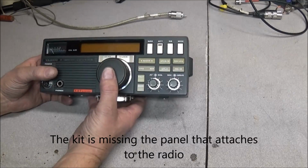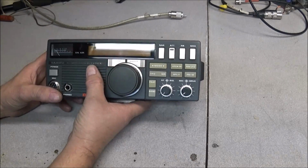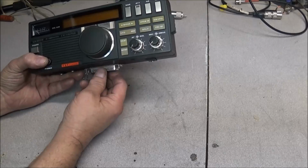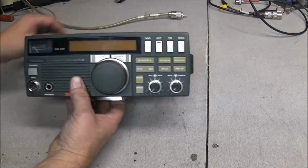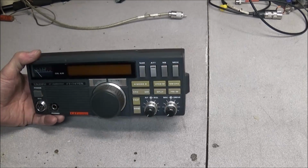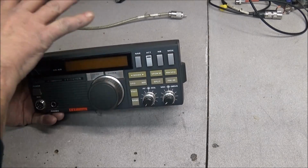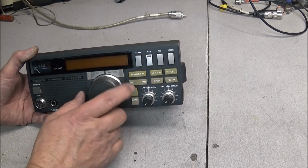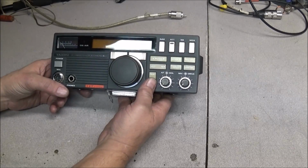But something else I'm thinking about, this would also make a great test fixture, not just for working on a 747, but with other radios. I could wire this into another connector and put it on a breakout board with maybe a couple of breadboards attached to it. So when I'm working on any kind of HF rig and I need to encode a function or a push button or whatever, this whole head could control that function just by putting it on a breadboard. So that's another possibility with that. Randy, thanks. I'm sitting here thinking, and yeah, this could have a lot of uses.